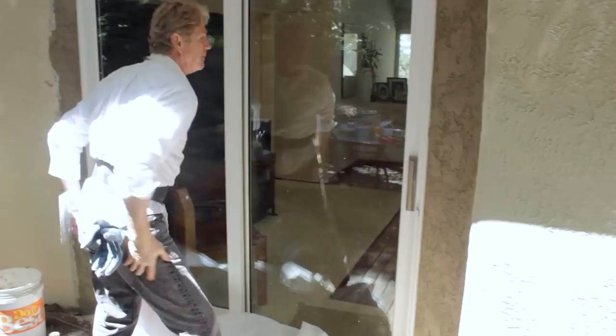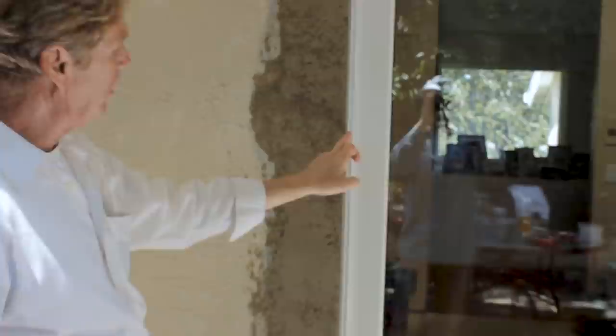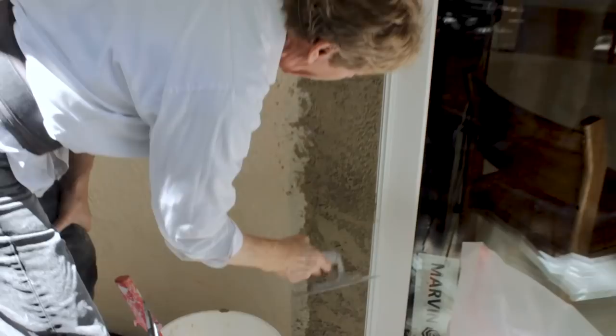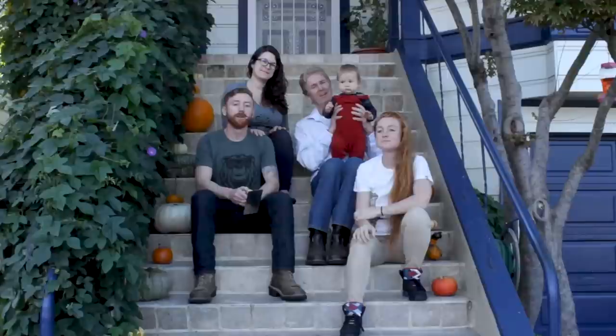When you tear this off, people used to call and ask: where is the expansion joint? In some states they require a J-trim right here so the stucco and windows can contract. For the last 15 years they've made windows with this gap built in — that gap is the expansion joint — to eliminate that J-trim. If you get any stucco in there, just pull it off like this little bit right here. My name is Kirk, Jason's on the camera. Thank you folks for watching — please like and subscribe so we can keep making them, and we'll see you on the next one.